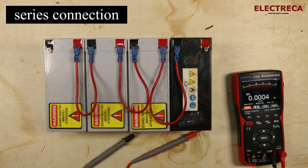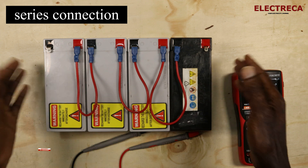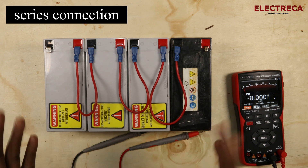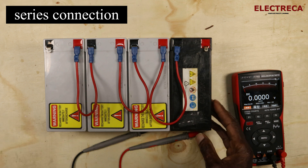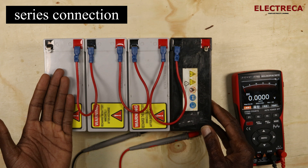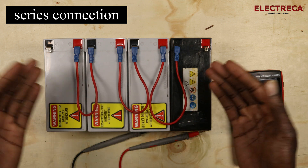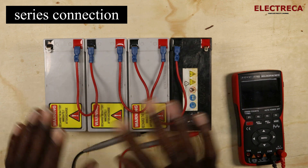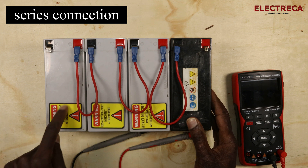You'd do this when you can't find a single 48-volt battery. You can find one battery that's already 48 volts, but those battery voltages may not be available on the market — what's more common is 12 volts and 24 volts. With four batteries connected in series you get 48 volts, but the system capacity remains the same — one battery is rated at 7 ampere hours and that's what you'll still get.